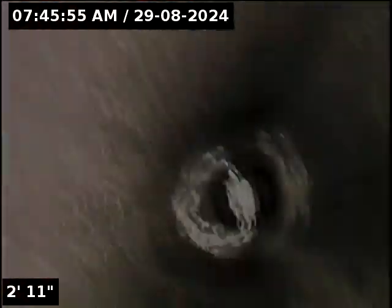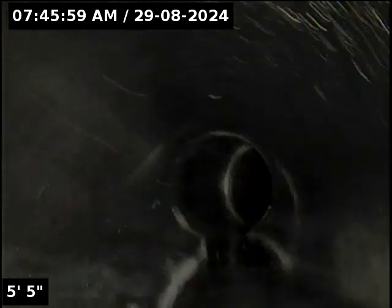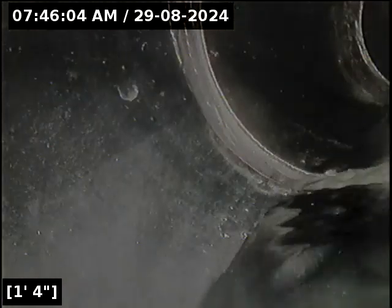I'm here on the northeast side of the house. There's Justice Street beyond that fence — backyard. In the ground here is a 4-inch ABS clean-out. This is where I'll be accessing the line for inspection. The purpose of this inspection is to determine the overall condition and serviceability of the sewer lateral for this property to the city main.